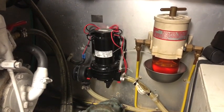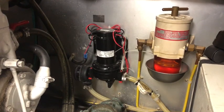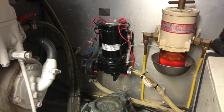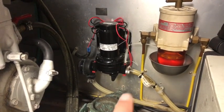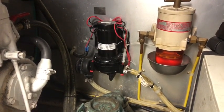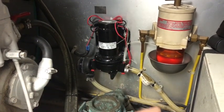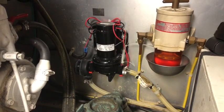It's a 12-volt pump that pumps 20 litres a minute at 30 psi. A lot of pumps pump less flow but more pressure. I got this because the previous pump fitted when I bought the boat was the same one, so I replaced like for like. It hasn't been without problems - the snapping connectors have never held the hosing and often vibrated out, so a rather elaborate zip tie arrangement was used to keep them in place.